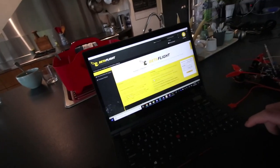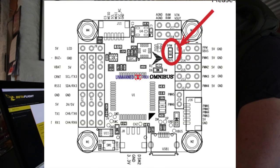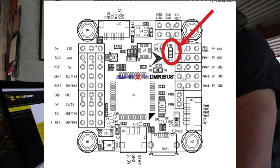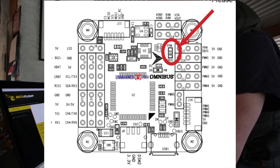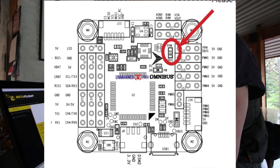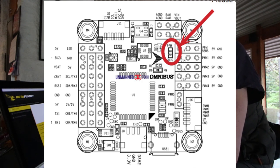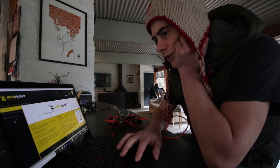First you're going to want to have Betaflight open with the most recent firmware. I'll show you what I'm doing as well as talking. I'll bring up a diagram of the Omnibus F4 V3 Pro. You have to connect the ground, the voltage, and the S-Bus. If you're running PPM or S-Bus, there's a tiny little tab and you have to solder the two joints on the side that you want — whether it be S-Bus or PPM — to select which input you're using.